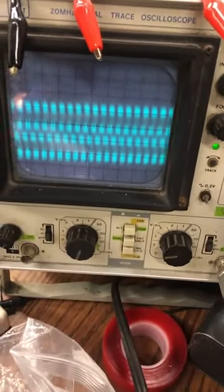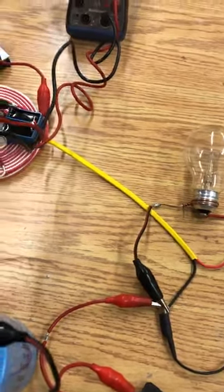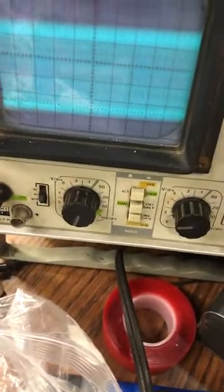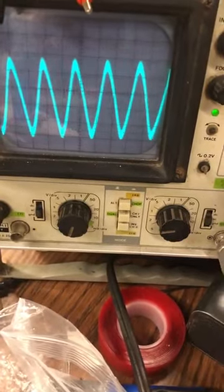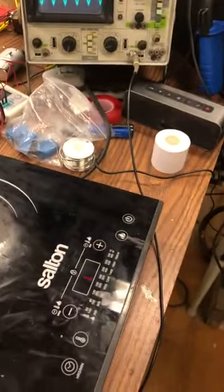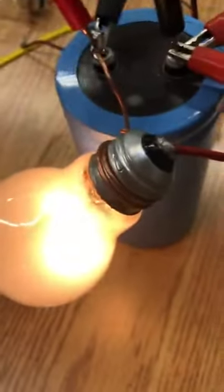There's the wave we're getting out with the DC cap and load. We'll take the load off — we're going back up to 60 volts DC, and you can see the wave has changed. The wave changed big time — that's the DC load. It's certainly putting out enough DC power: 48 volts DC at this capacitor, which is a large capacitor rated at 250 volts.